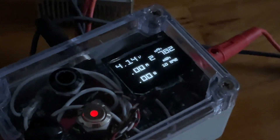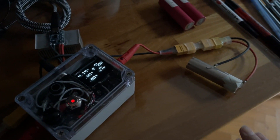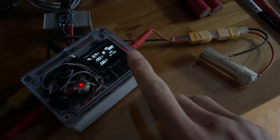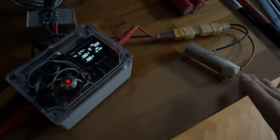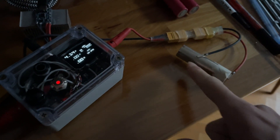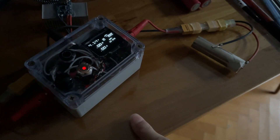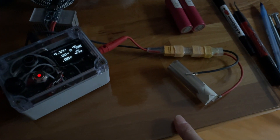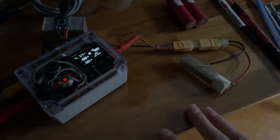It finished charging and came in at 2.7 amp hours. The capacity is going down, so the cell isn't in the best health — or at least not high quality. Ideally you'd let these rest for about a week and check how much they self-discharge. I'll note the date in the comments. Not as bad as I expected, honestly, for sitting at zero volts for roughly a year — it's been interesting.